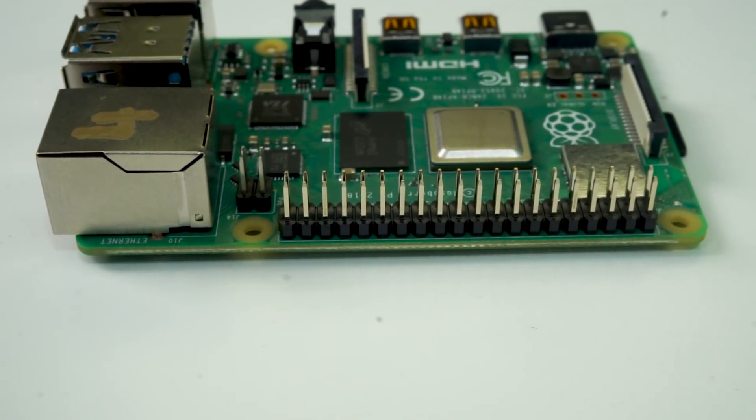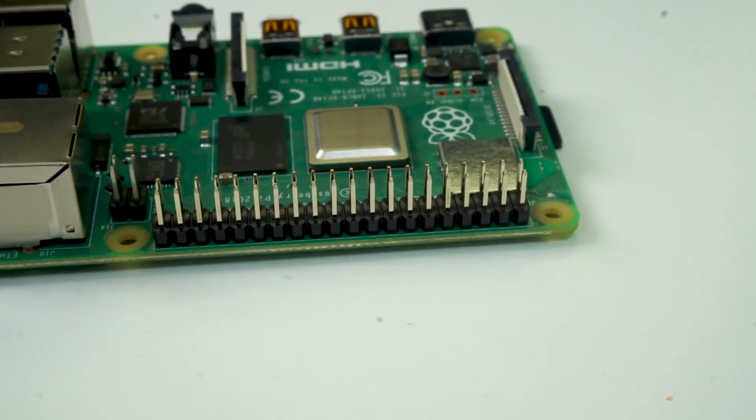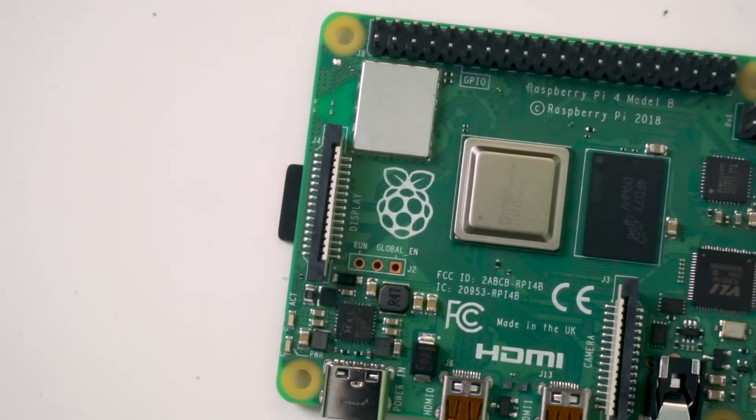The third purpose is that you can actually interact with hardware. The Pi has 40 GPIO — general purpose input/output — pins that can be connected to hardware. For input, you can have a temperature monitor or humidity monitor. For output, you can control switches, LEDs, and even stepper motors. It's great for seeing the interaction between hardware and software across all kinds of projects, including robotics, ecological systems, and weather monitoring.